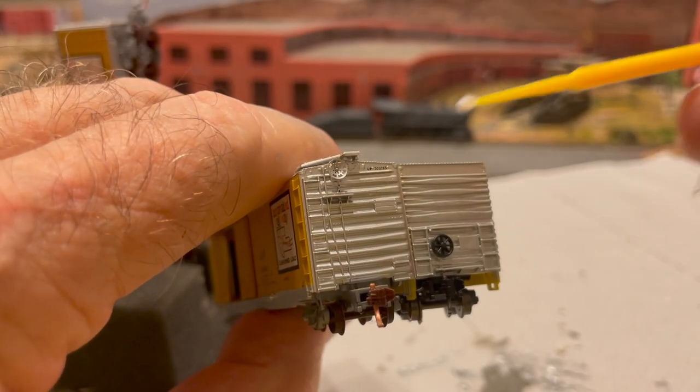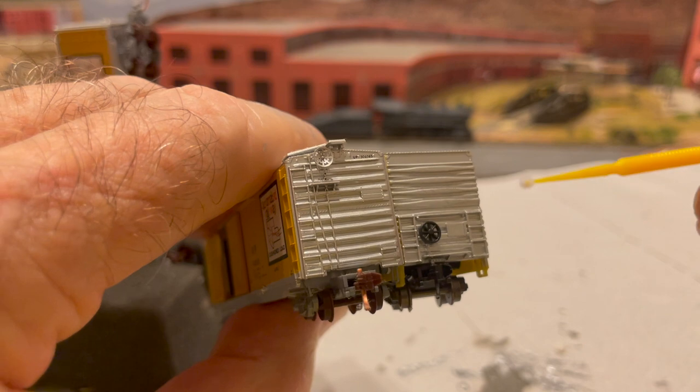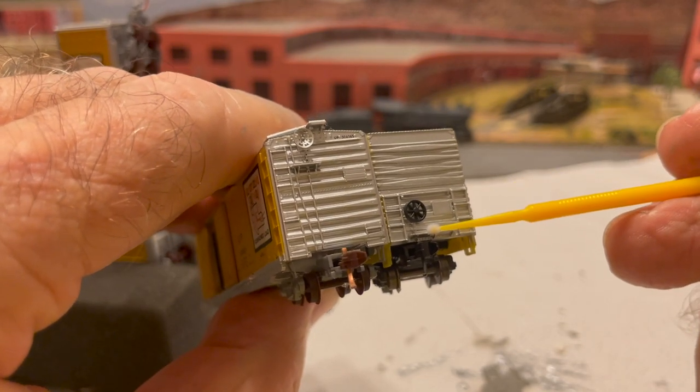Thus, the last of the roof walks disappeared by the early 1980s, about the same time that cabooses disappeared. And also at that time, brake wheels were moved down from where they used to be to where you see them today. Handbrakes are still used on parked freight cars as an additional safety measure, since the compressed air stored in the car's pressure tanks may leak out. A crewman now sets the handbrakes by moving from car to car on the ground instead of on top of the cars, and he does this while the train is not moving.